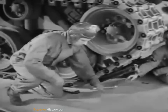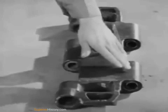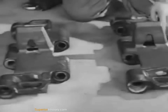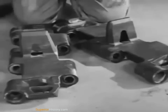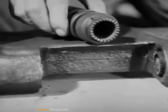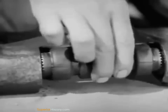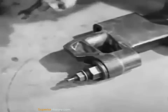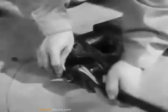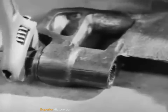The need for the bushing pullers becomes clear when a couple of disassembled track links are examined. Each track link has five bushings — three on one side, two on the other. The bushings are serrated on the ends, and when the links are together the serrations are engaged. Thus the bushings become one unit after the track pin is installed. To disengage the serrations, the bushing pullers are used: insert a puller inside the bushing and tighten the screw, then turn the puller nut. This separates the bushings.